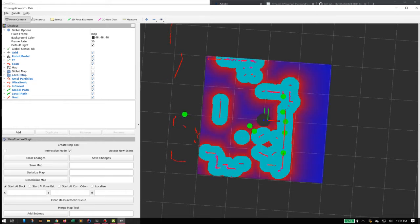As ROS processes the scan, it starts to create a local map. This is right here. This is sort of a heat map showing you where the obstacles are. So you can see it's created these blue lines, basically saying this is a wall. Don't get near it. The wall is what's showing red now. It's also the scan line. The blue is the expansion of that wall, saying okay, well we know how big we are, so it should stay that far away. And then sort of a gradient here, and it's basically going to stay in that blue area.